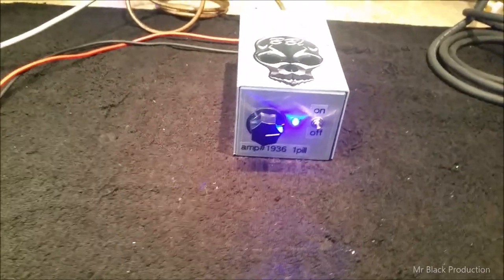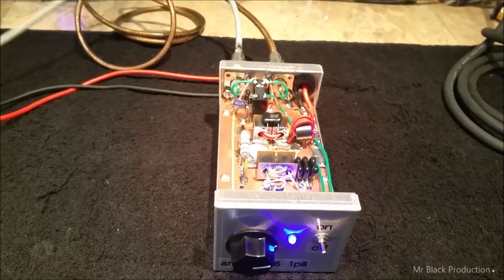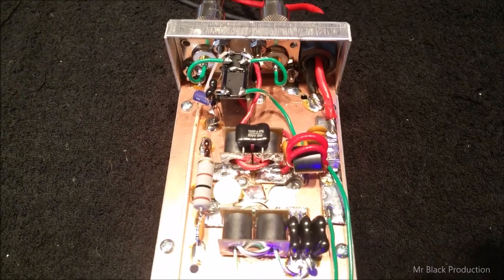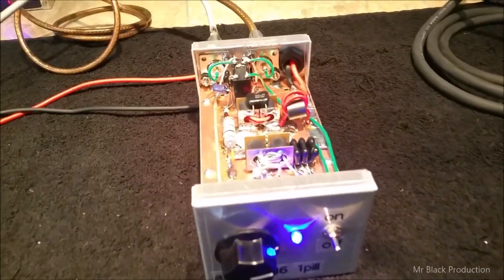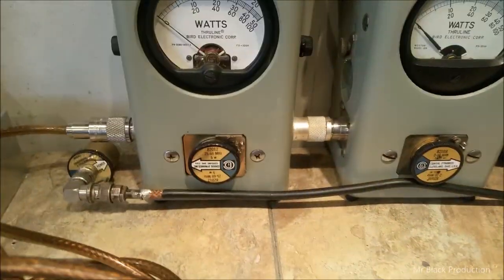We're going to talk about the one pill first, and then we're going to come back and talk about the other bass unit when we're done. Danny ordered up just a little straight one pill modulator. We got a little 2879 down in there. We're going to run it on 14 volts. We're going to hit it with the Striker 955 with a 5-watt slug between the dummy load and this little bad mammer jammer: 1,000-watt slug and peak, 1,000-watt slug and average, 5-watt slug and reverse.